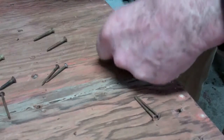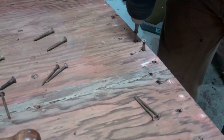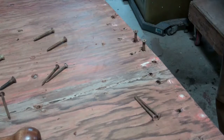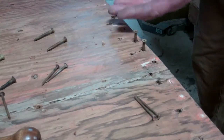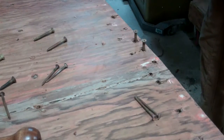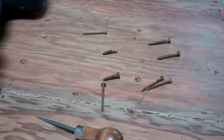We use various kinds of picks and awls to clean these screw heads out. So I'll continue removing every fastener along the transom, both starboard and port. The owner did some leak tests and water just surged through the seam between the bottom plank and the transom. So we're going to release this up, actually open it up and pay in 5200 to about here, then screw it back down so that we have a good tight seal along the transom. As you can see when I turn this around, you know what I'll be doing today — there are quite a few screws in front of me and we'll be removing them all.